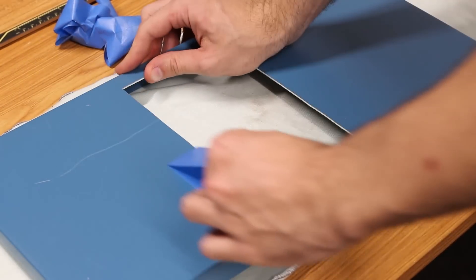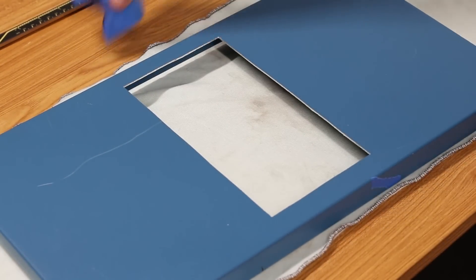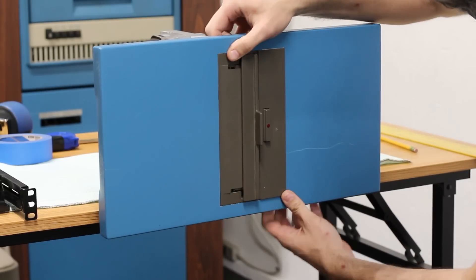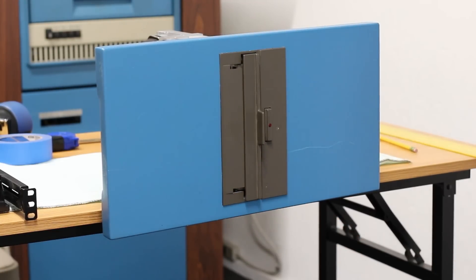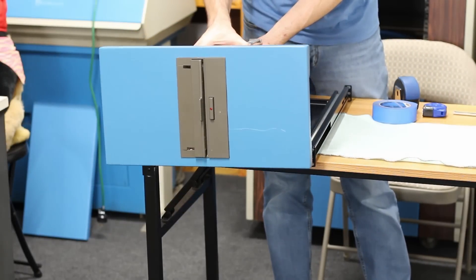I'll cut a smooth arc until I reach the cut lines drawn earlier. That arc leaves a little bit uncut in the opposite direction, so I'll flip around and cut towards that corner as well. With the long sides done, I'll do the same on the short sides with a tighter arc, working carefully towards each corner — and it cuts out easy peasy. Back on the bench, peel the tape off and see what our freshly sliced panel looks like, then mock it up on the actual floppy drive.